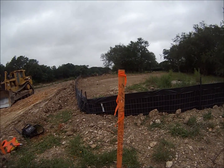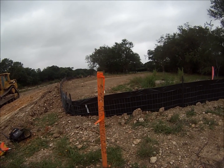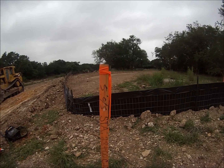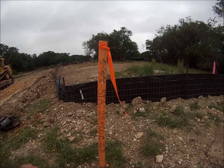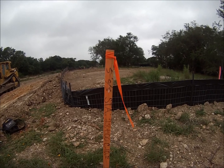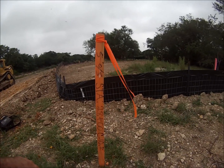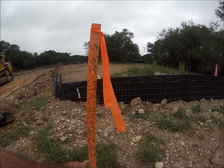There's going to be a little bit involved with this but I'm going to explain it as best I can. This stake right here is an offset stake — the five right here is a five-foot offset. OS is offset. The station number is 28 plus zero zero, and what that is, it's a reference point for you to go to on your plans and see exactly the detail and profile of this particular station. From this point right here at this stake, I've got a cut of 10.54.